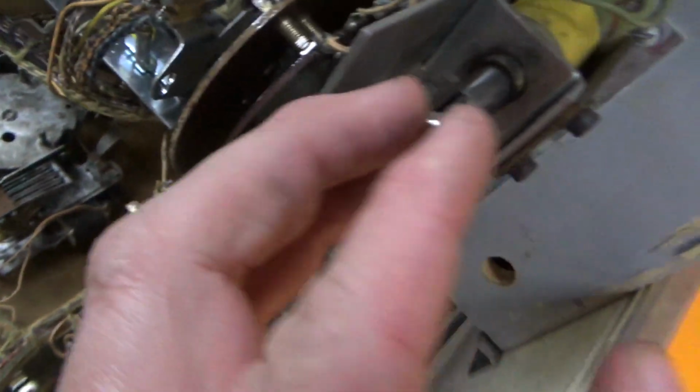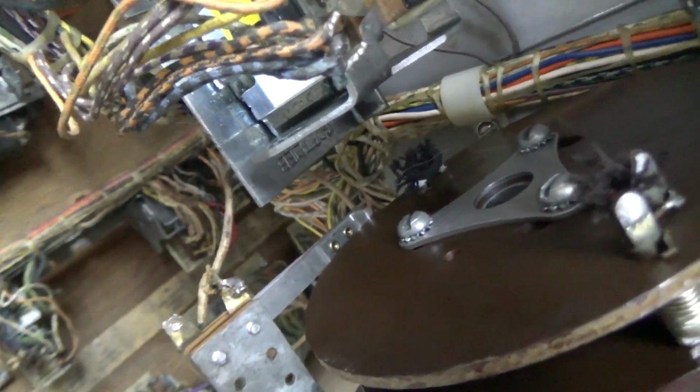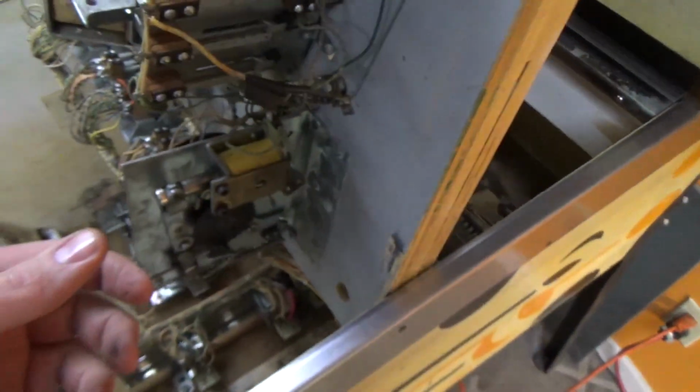Okay, so it's the end of the ball. The ball lands in the out hole, which connects the circuit, and it starts this sucker firing, right? It's already connected up here for some reason, but it goes bam, and it moves to the second position, and if that drop target's down, it gives you 1,000. And then it goes bam, bam, bam, bam, till it gets to the thing again. So it's going to go da da da da da da.